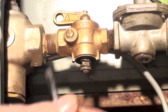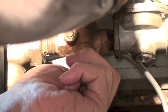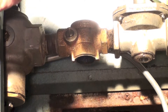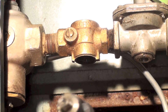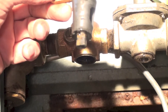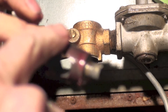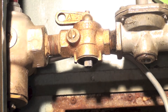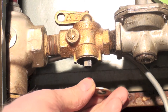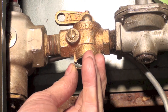I'm going to pull this valve apart because we had leaking in it. You can see it's a taper — there's supposed to be grease on it. I don't usually carry the grease with me and I don't really want to fix these things, but I'll try a little bit of general-purpose grease and see what it does. I've greased this plunger and tried to spread it around pretty good. Make sure it's absolutely clean, put it back in like that, and then tighten it down. You don't want it real tight or it won't turn.